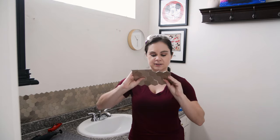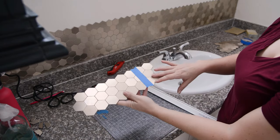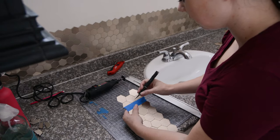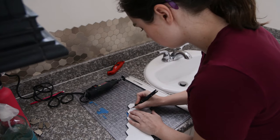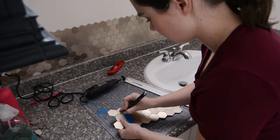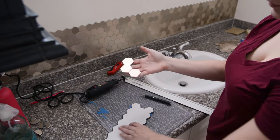Last night I got about two rows of peel-and-stick tile on the wall. The peel-and-stick part is super easy — just take the backing off and press it against the wall. What is challenging is creating straight cuts on the edges to fit them in the odd spots on the wall. I've marked with blue tape the length I'm keeping, then I use an X-Acto knife to separate tiles and score through the adhesive. Make sure your finger is not behind the blade when you do this.